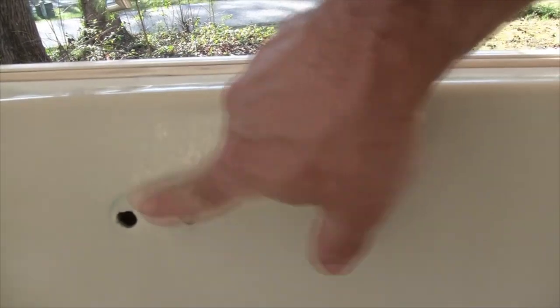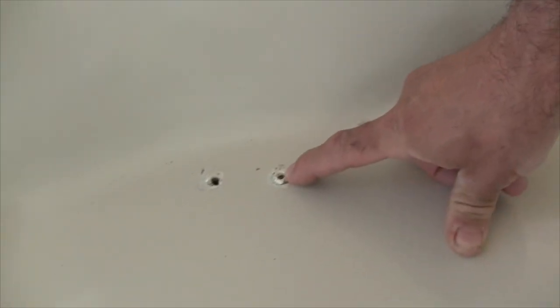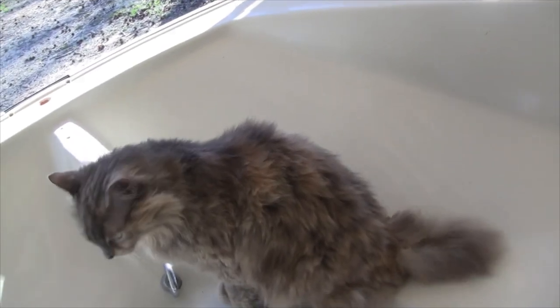Let me give you an idea of the kind of holes we're dealing with. Some of these are from the old console, which will be remounted — I'm not going to use the same holes, so these will be completely filled in. We've also got holes for the cooler. There's also a really bad repair job down here, so we're going to be drilling out most of this, filling it with enough epoxy to make it flush, and re-drilling those holes. She's inspecting — pre-work inspector.